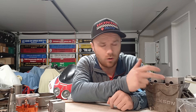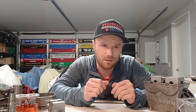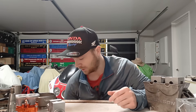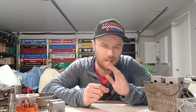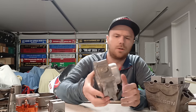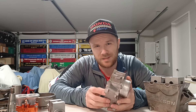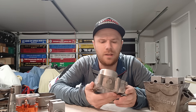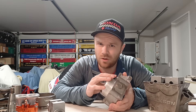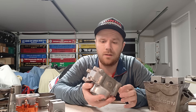Apart from those two things, everything seems to be coming along relatively smoothly. Pretty happy with the progress on the cylinder head with cam caps and the oil system done. I do need to line bore the cam caps and the head at some point, but considering I haven't designed the camshaft yet, it'd be a bit ambitious to do that before then. The cams will probably be made out of some 4340 which I have here — just whip them out and they should be good as long as they're pretty hard and get plenty of oil. As far as casting, every time I look at a part with porosity in it it makes me sad, so I want to master the casting of these engine parts. I'll be doing some vacuum casting in the near future and updating the design as well. Until then, this has been Logan from the Motorcycle Forge — I hope you enjoyed and I'll catch you next time.